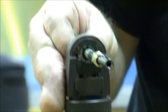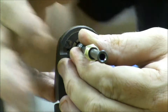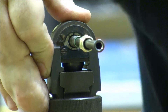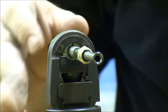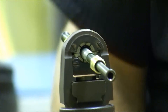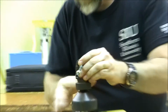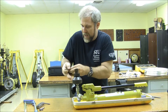Watch closely in here as those jaws compress. Get everything in position, and there we go. We're getting close to about 5,000 psi, and that is adequate to do our swaging job. Release the pressure, disassemble the mechanism, and that has swaged one side of our tube.